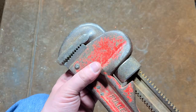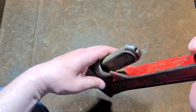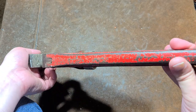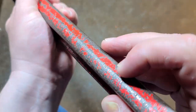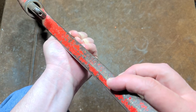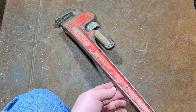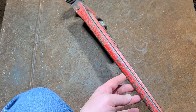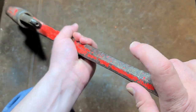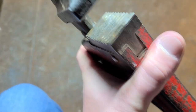It's using the modern two-piece design instead of the old Stilson where they have the rocking carriage. It seems to adjust just fine, and once again there's plenty of capacity. It has a forged upper jaw. My understanding — and you can really see there's just a thin line here — is that I don't believe this is a forged handle. I believe that most pipe wrenches have cast handles, though maybe some are forged.